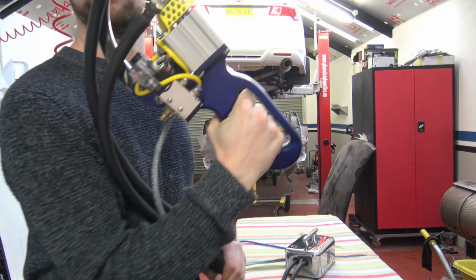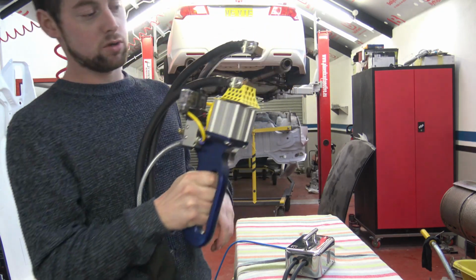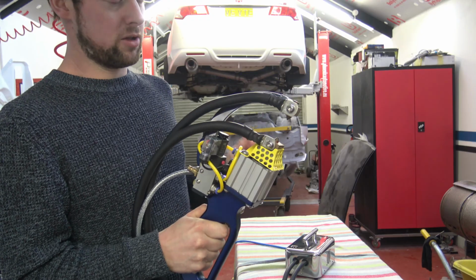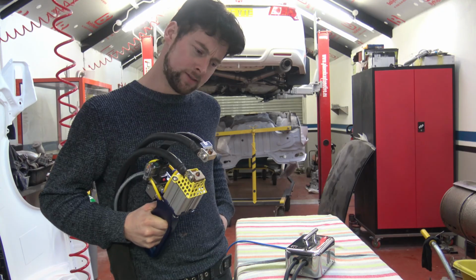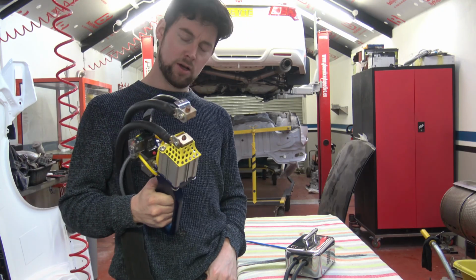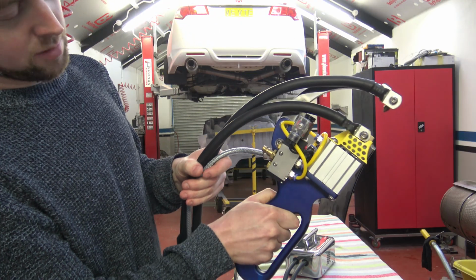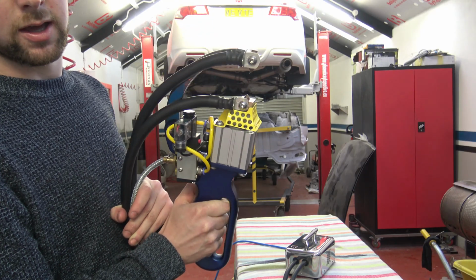I'm going to just show you first the pneumatic piston shooting out. The transformer won't kick in because there's an off delay of 1 second. I think I have it set up for 1 second. So, alright, there's the valve clicking when I push the button. It doesn't latch for 1 second, so the transformer doesn't kick in.